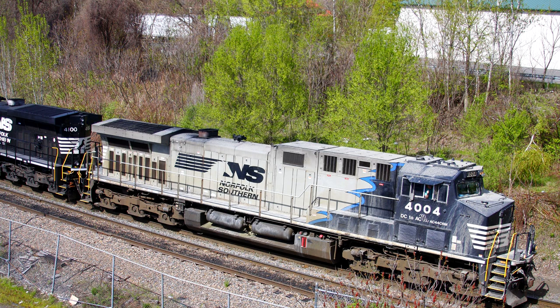which were mostly in Heritage 1 paint and still had the three-pane side windows. My guess at the time was that they were the next in line to be rebuilt after the former Santa Fe 600 series. The 700 through 799 series BNSF Silver Bonnets were actually younger than the 960 to 1123 series and were the first C44-9Ws to have the four-pane side windows that have become the standard on all subsequent BNSF GEs. Last I knew, many of the 960 through 1123 series had been largely stored at various locations around the BNSF system, particularly in Barstow, California.